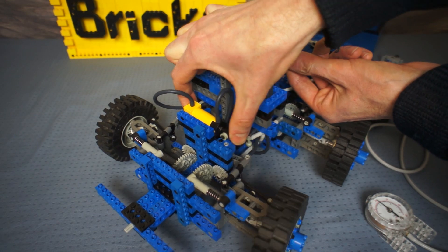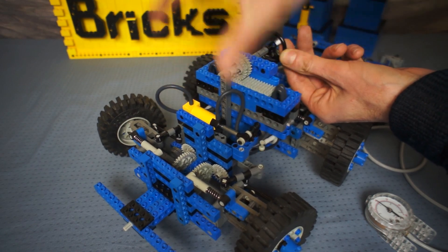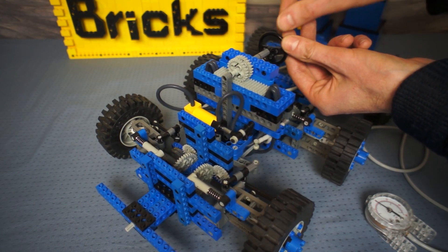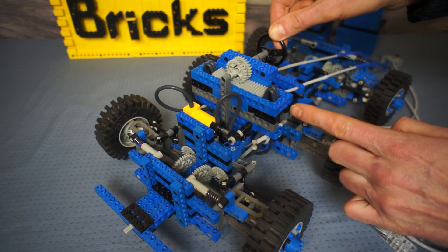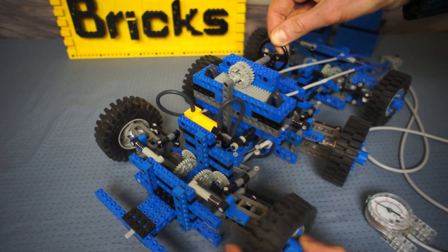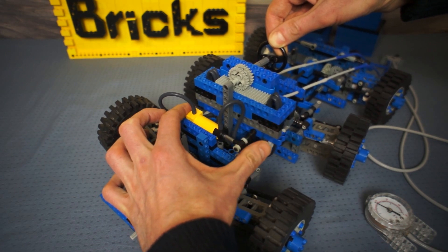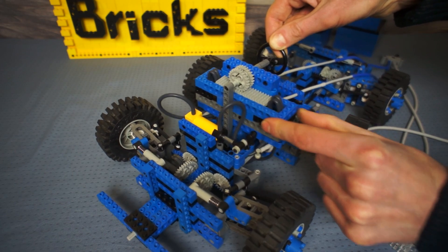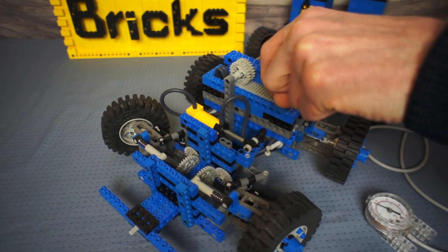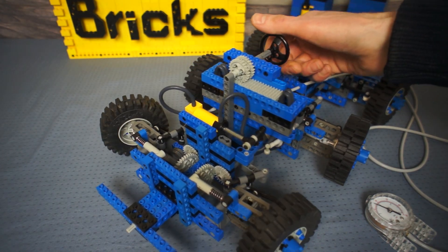Here I'm holding the steering wheel and trying to change the position of the steering by pressing on the cylinder — like driving over bumps or going off road. You can see the system correcting itself, because moving the outer switch body while keeping the gear rack still is equivalent to moving the gear rack. It changes how much the switch is open and returns it to its original position. That's why it's a servo — it follows its own position and gets back to the target position.